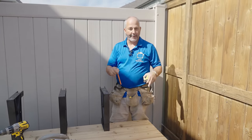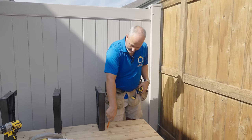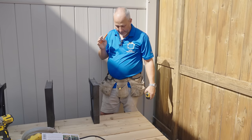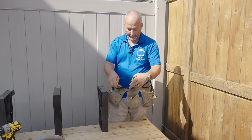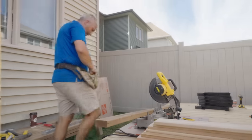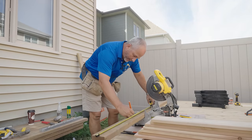I'm just going to cut 4 2x4s at 22 inches. I'm going to cut a bunch of boards that are the full 1x6, that's my outside dimension. We're going to go 18. And because I like it to be super sexy, I'll just use the miter saw. We're going to cut everything with a miter joint in the end to meet nice and clean. Anyway, enough talking, let's do it. All right. Cut 22.